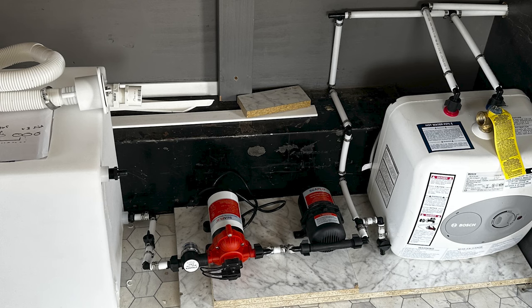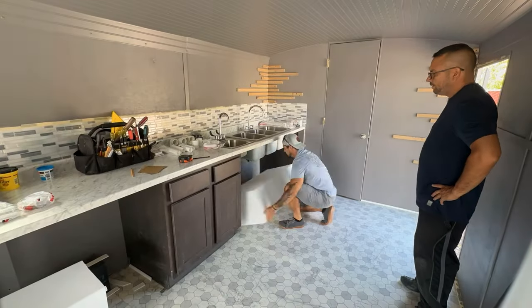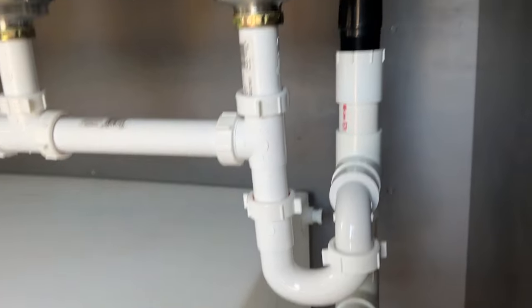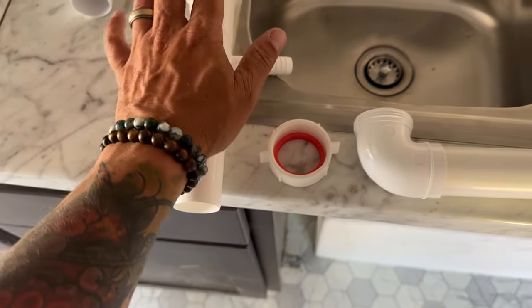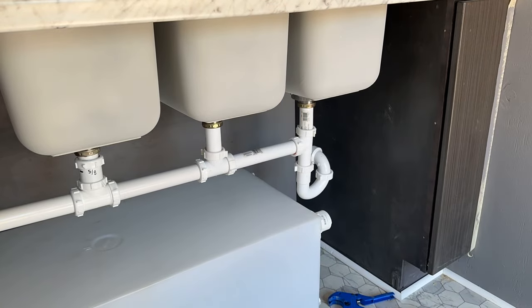You'll also need a sediment filter, a hot water heater, and fresh water tanks with inlets. I use both a gravity-fed inlet as well as a three-quarter inch garden hose inlet. Gray tanks — that includes P-traps, vents, and your RV drain to hook up to your gray tank. If you're hooking up your espresso machine, you might need a BSP fitting — British Standard Piping Fitting. Kitchen sink drain pipes at one and a half inches and Schedule 40 pipes at one and a half inches. Even though they're both one and a half inches, they are not the same size and you will ultimately need an adapter.